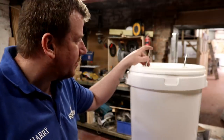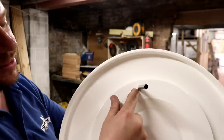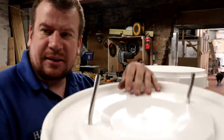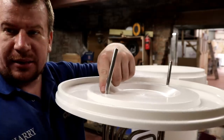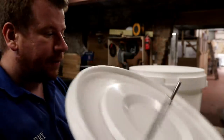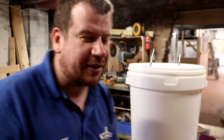There's the controller, there's the fermenter, there's the cooling coil - all I need to do is attach some lines, put some glycol in the cooler, and give it a leak test before it goes into use tomorrow. I've never had a John Guest fitting leak on these kind of systems, so I'm comfortable using it. The holes in the lid are tight - it wanted to be about 9.8mm but it's only 9mm so it's been forced in. There's a ridge on that section, so if we do get any glycol leaks it'll just roll off into the divots on the lid. And thirdly, we're using monopropylene glycol which is food grade, so if there were any leakage it's not going to harm anyone who drinks the resulting beer.